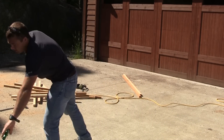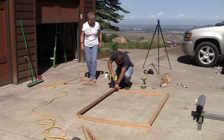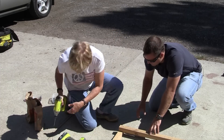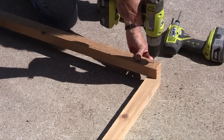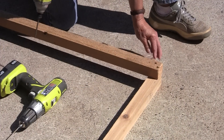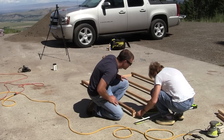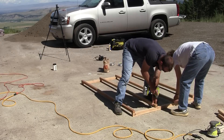Next, clean up the work area so we have a flat surface to work with and begin assembling the trellis by laying out the 4 outside boards. You'll want to drill pilot holes for each screw to prevent the wood from splitting, and it's handy to have a second drill or an impact wrench to put the screws in once those pilot holes are made. I like to put two screws in each of the four corners to help square up and prevent the frame from pivoting at each point. Then measure and space the remaining two vertical boards evenly. We used two and a half inch wood screws for this project.